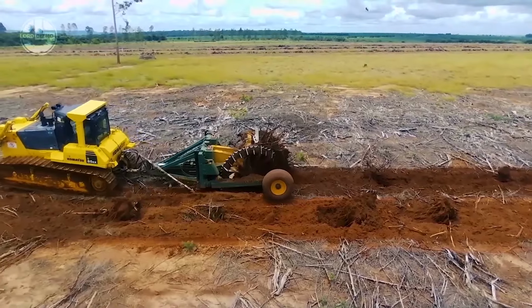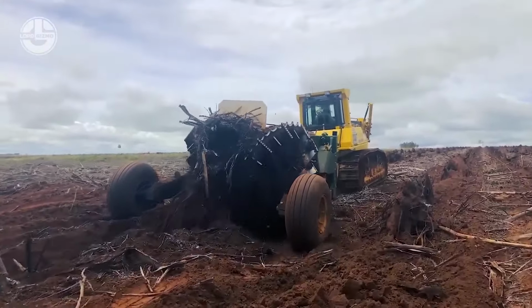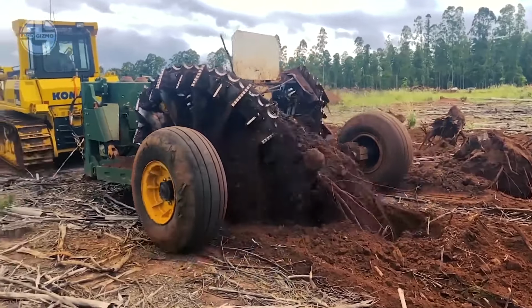With the combination of a 1720 stump puller and Savannah Rotary Rake Equipment, it can convert post-harvest to windrowed stumps at a rate of 20 to 40 acres per day. All done with only two tractors, one stump puller, and one rotary rake.